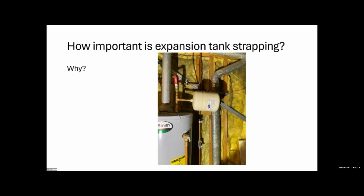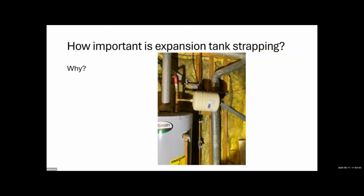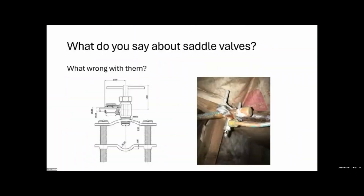Supply houses now have cool brackets and side-mount options for expansion tanks. Ideally it's oriented vertically, supported by the tank itself with the supply going out the side. To check for waterlogging, knock at the bottom then at the top — you should get two distinctly different sounds. There's a very clear difference: the dull side, like a full sound, means it's full of water.